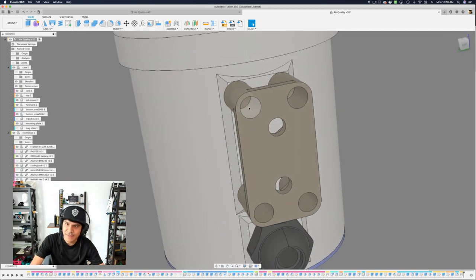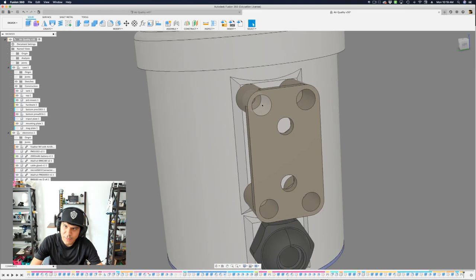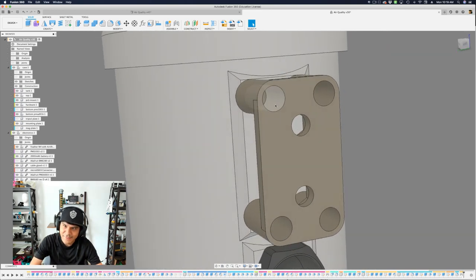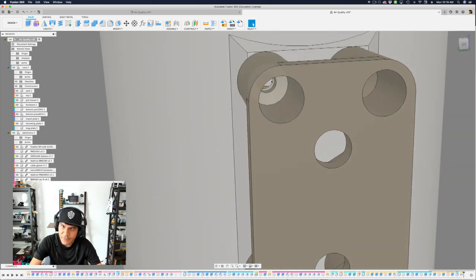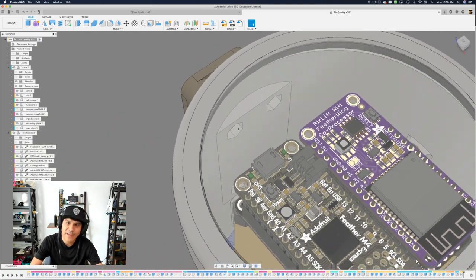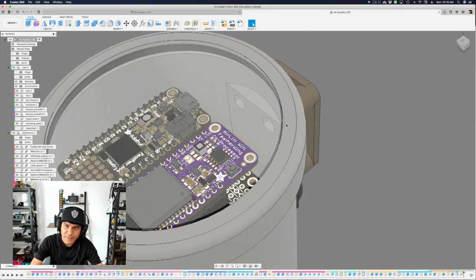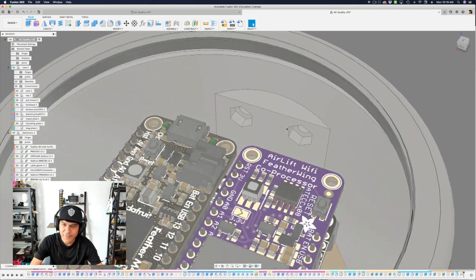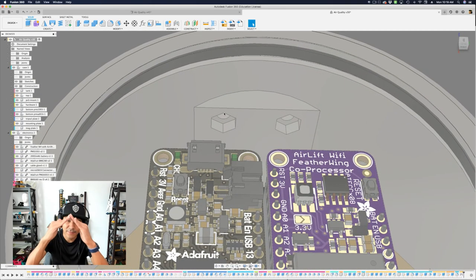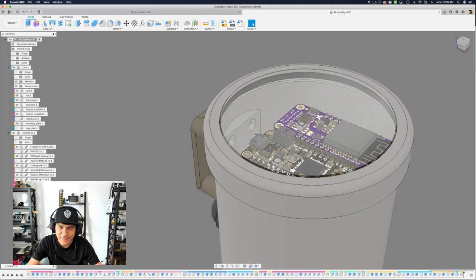The method I used for attaching was to create counterbored standoffs — they're chunky to accommodate the screw head. The screw head fits all the way in, and on the inside are hex nut recesses so you can press fit hex nuts and the screw caps that hex nut. A tip for using hex nut inserts: always think about the orientation of the hex nut. You'll see the tip points upward so that when 3D printing, there's no issue with overhang because it meets at the top. If you're doing hex nut inserts and printing the case vertically, that's a good thing to note.